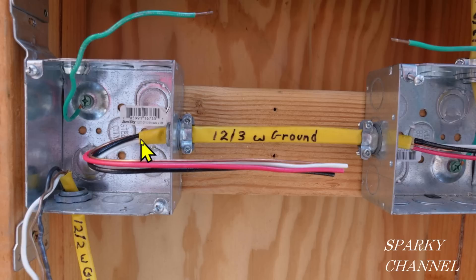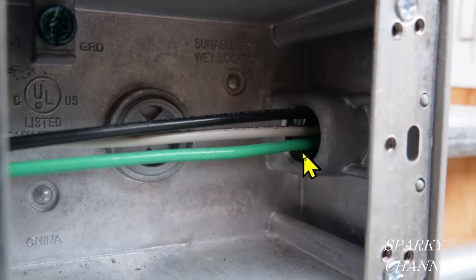So there's your code: it starts from the edge of the sheathing and it's got to be 6 inches. And the way I read it, it's got to do both — it's also got to exceed 3 inches from the edge of the box. Here we have wire emerging from a raceway, so we would start our measurement right here where it emerges from the raceway, which in this case is EMT conduit.